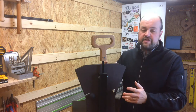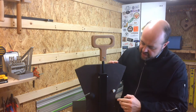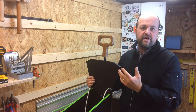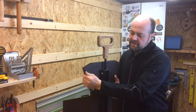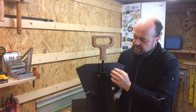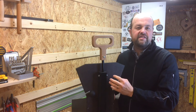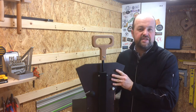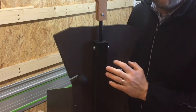First, I had some pretty bad tear out when sawing these cuts here, because I wanted the clean surface to be on this side, so I used the jigsaw blade to pull in this direction, and I put some masking tape on this surface, and I thought I could prevent the tear out with that. But this surface of the resin-coated plywood is a little structured, so it's not exactly smooth, and that prevented the masking tape from sticking very well. So it didn't stick very closely to this, and it didn't prevent the tear out at all. As you can see here, it really is some pretty bad tear out.